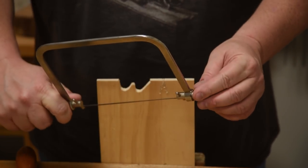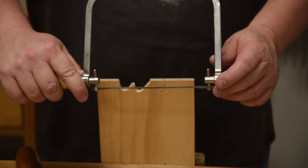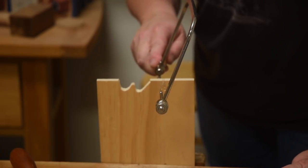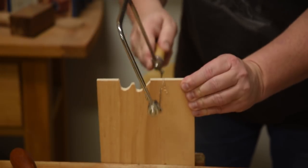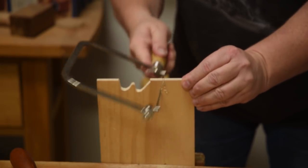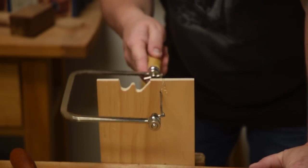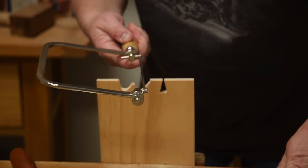Having said that, I very rarely cut curves with a coping saw — I have a scroll saw for that. This tool is what I use for getting rid of wasted dovetails. You can slide it down the curve established by your dovetail saw, then come down to the baseline. I can actually get the saw moving and slowly turn in one spot. My pressure goes up one way because I'm only cutting on one side of the blade — using the set of the blade where the two teeth go to each side. So if I cut on one side I can kind of turn a triangle, and once I get it going straight across, I can cut out a dovetail waste. I use the set of the teeth to turn an edge in one spot, and then come straight across.